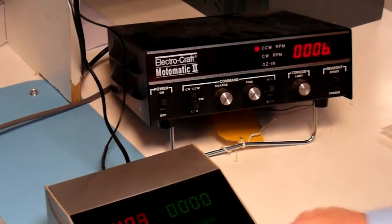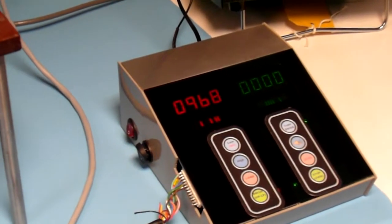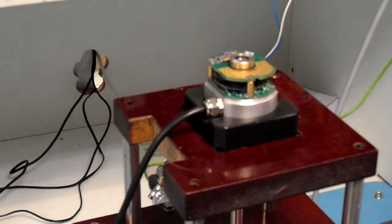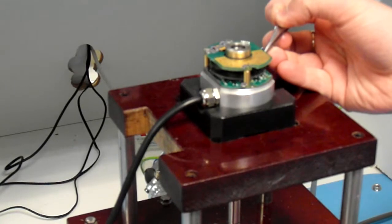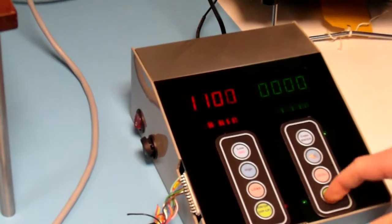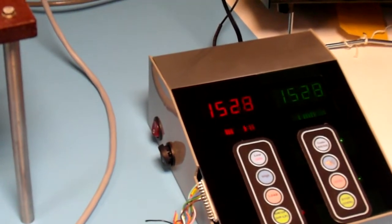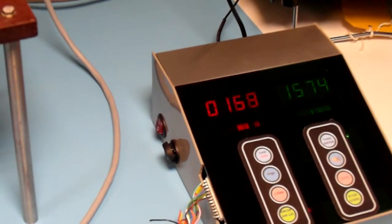So we've stopped the test. Now we're going to try and contaminate the disc to show you an error. I'm just going to put a thin little washer on to show. I'll redo the test. So turn the motor on. Again, holding low and run. And it's picked up the error straight away. So we start it again. And as the washer's gone round, it's picked it up and it's erroring on 1574.